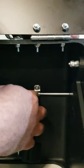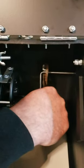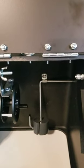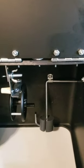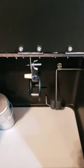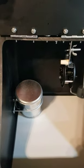If you have to, you can take that back off and just close it up. Or another good little trick that I learned is if you put the pliers on the top of the nut, you can squeeze a little bit, and that closes that right up, and it sandwiches it right to the back of the box, and then it's in there good and tight. Once it's in there, you're not going to have to worry about it. But that's only if you're trying to tweak your flag and get everything nice and straight, and so that part should be fairly easy.